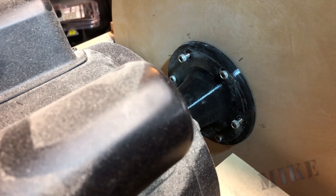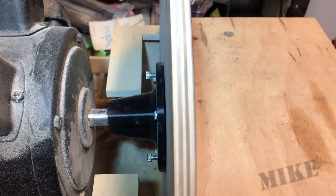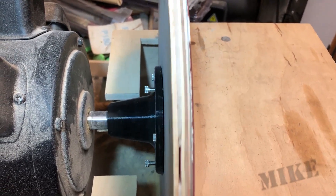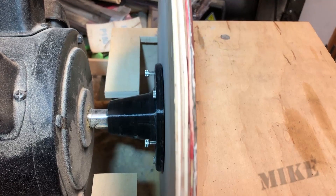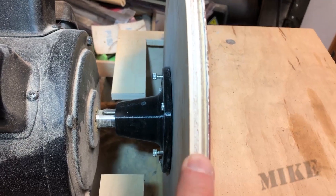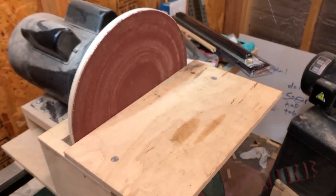These act as springs and push the wood away from the hub. Now I have three points of contact and three points to define a plane. By torquing these bolts down to different amounts, I was able to take out about half the run out. That worked out really well. Hopefully this will inspire you for one of your solutions to one of your problems.